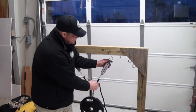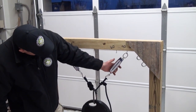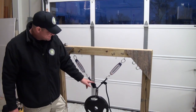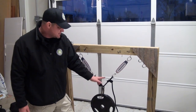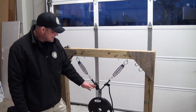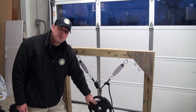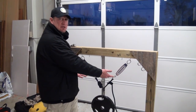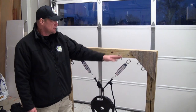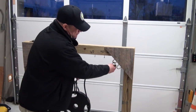Taking this back to that 90-degree marker, this scale immediately comes up to about 16 pounds and this scale is at about 17 pounds. Again this isn't an exact angle, but you can see we're awfully close to 90 degrees and on each leg we have not exceeded the load but we've exceeded the median of the load on each leg. So in actuality, even though this is a 25-pound plate, the resultant force around this anchor through this anchoring system is in excess of what the load actually is, just at 90 degrees.